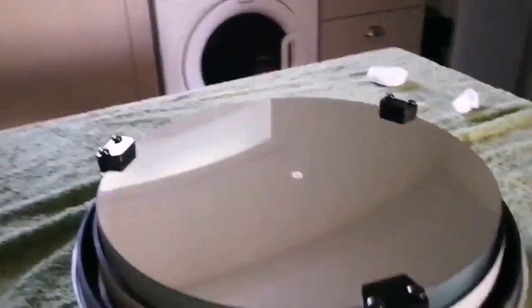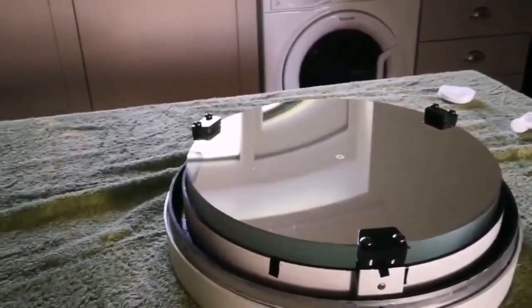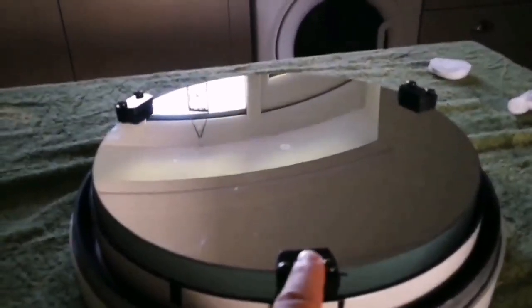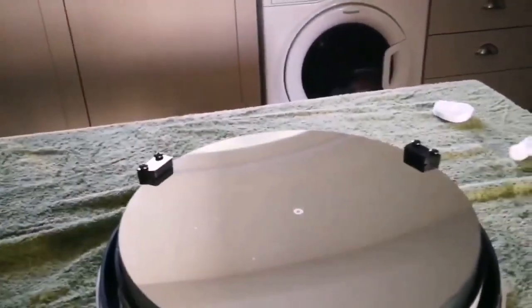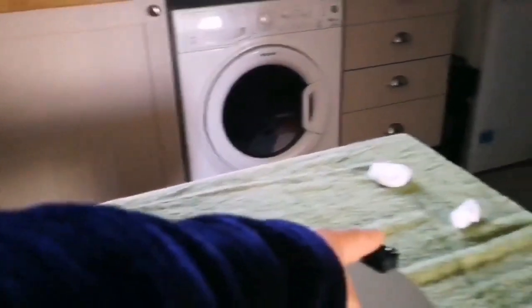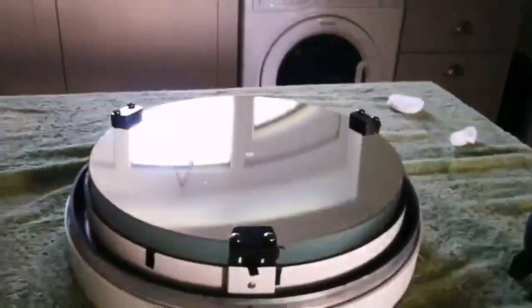The mirror is done and ready to put back in the telescope tube. I also need to clean the telescope tube. Remember to tighten up the screws, but not too tight — do them a little by little, going around gradually, so you don't introduce any stress to the mirror. The mirror is now back in the cell and ready to be used. I'll check the collimation after that, then wait for darkness.